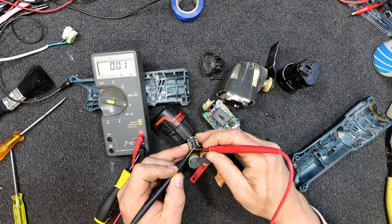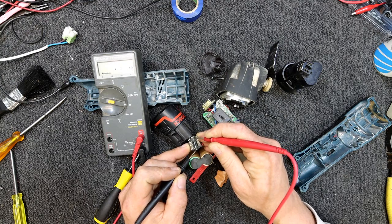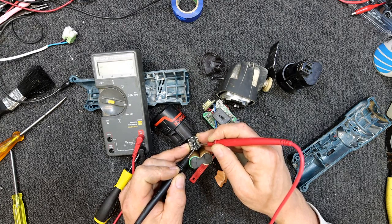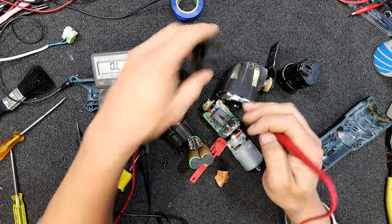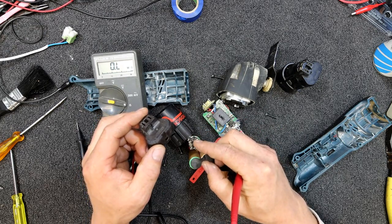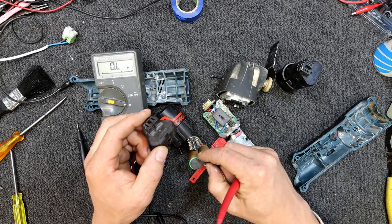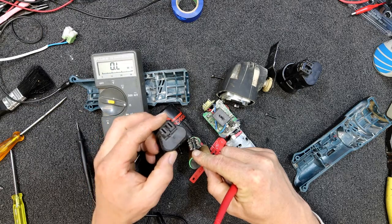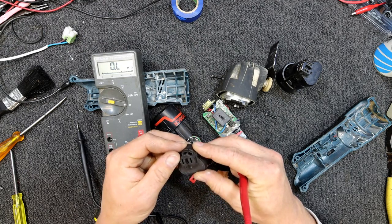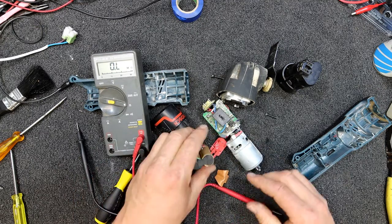So it could be something again to, you know, stop so you can't use someone else's battery in here. Who knows what these so and so's have been up to. And that's connected to that terminal, which is negative. So it looks like we've got like a thermistor to negative plus a 1k resistor from the other side of the thermistor. So one side of the thermistor to that terminal, goes through the thermistor back to ground, and then this one, middle pin's got a 1k to ground. One's labelled T for thermistor maybe, I don't know, and the other one's labelled C for charge or something, who knows.